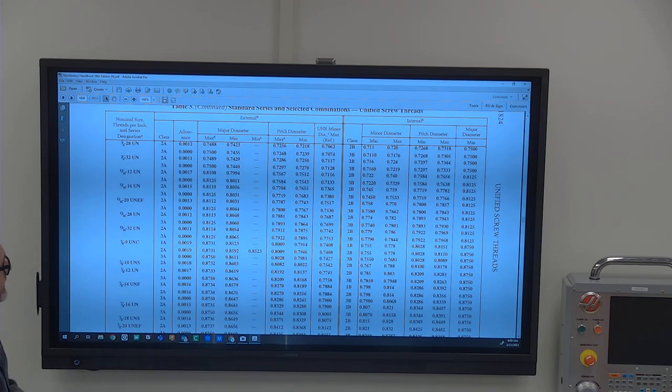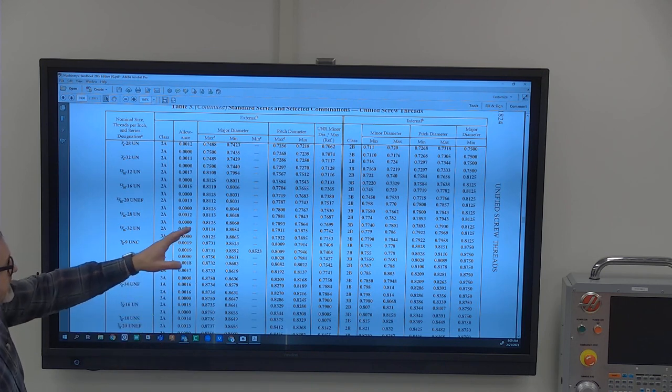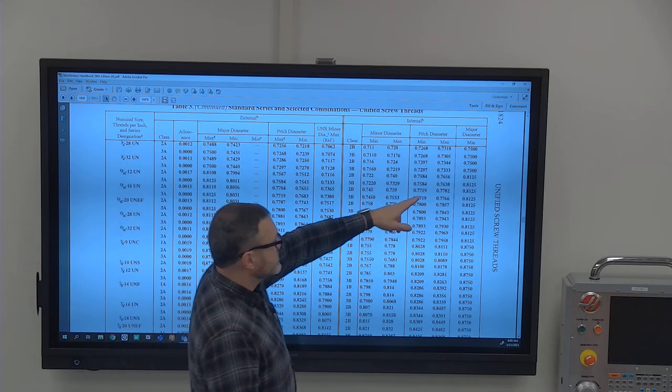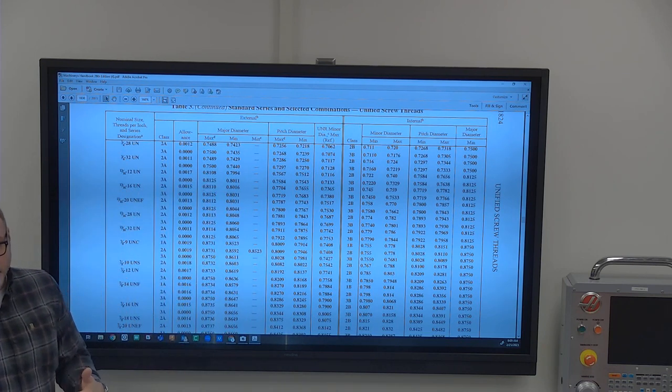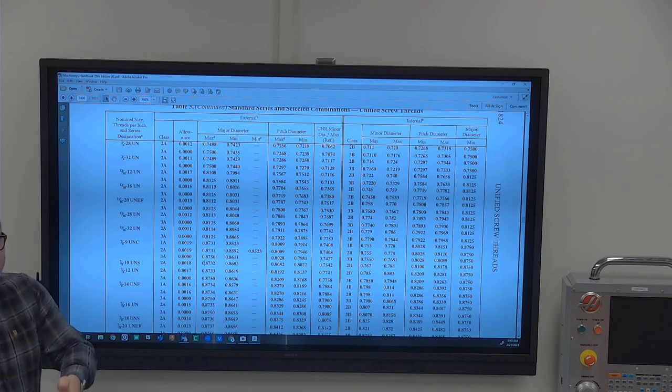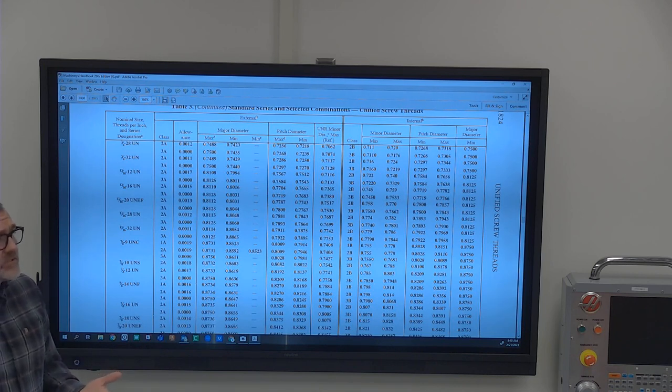So we've got that one, and then pitch diameter, we're either going to run a tap through it, roll form it, or single point it. We're not going to be able to measure that one. It's going to come out close to major diameter, should be about 750 on that, but that would be unmeasurable. You can't measure the major diameter of a nut, because you can't get to the major diameter of the threads of it. Everybody with me on that? Unless you use a wax or some type of gauging, or you cut it in half. Like if you wanted to do a destructive test, cut that baby in half and check it. That's why we use a lot. I'll go grab a couple thread mics anyways.